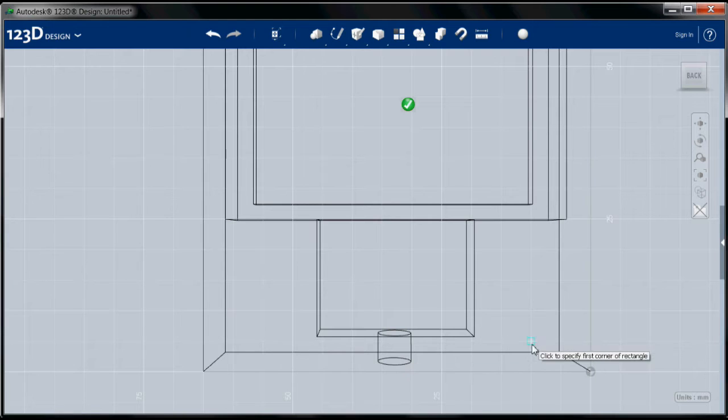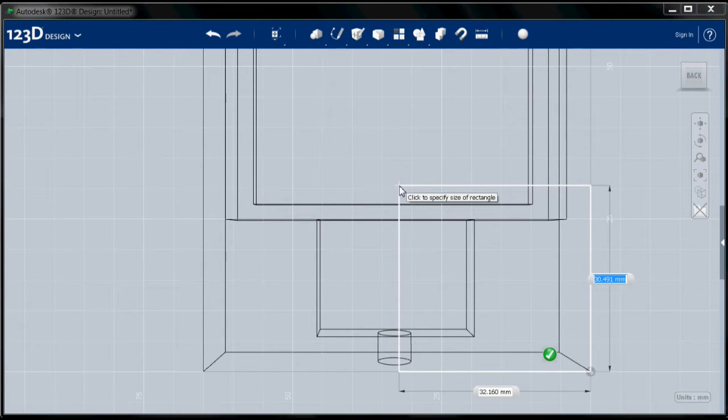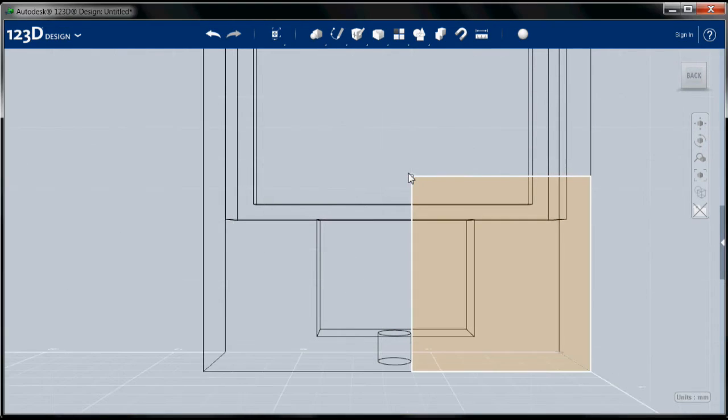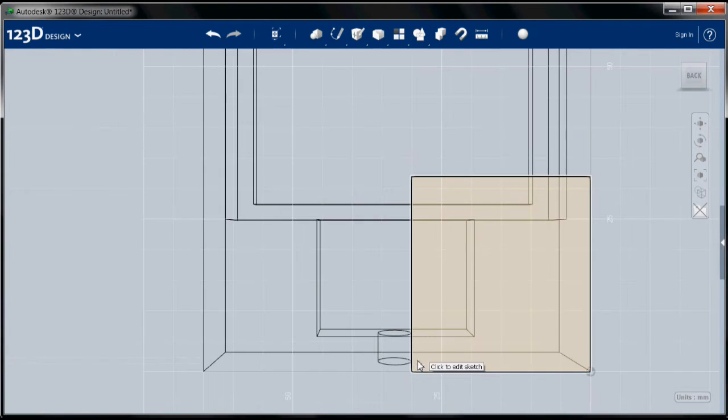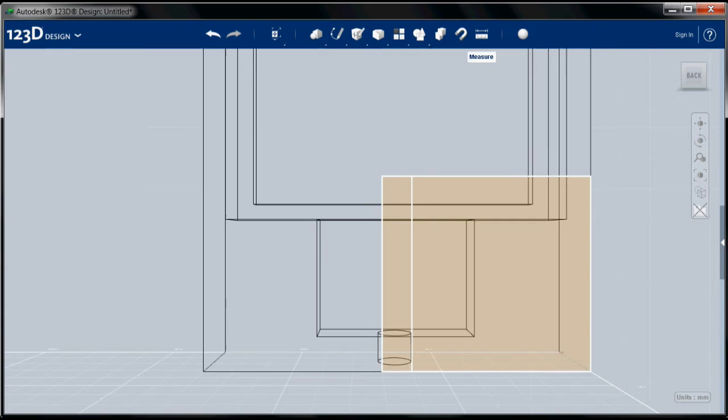So, this is a 65 millimeter wide part, and I want this to be a 5 millimeter wide channel in the center. So, I'm going to start at the corner, and I'm going to go in 30 millimeters. And I want that slot to be slightly above the shelf, but not too far above. So let's say 32 and 30. So this rectangle locates one edge of the slot that I want to bring up. So I'm going to go to rectangle again, this sketch plane, select here. Going to go up this high, so I'm going to go up 32, and my width is going to be 5.